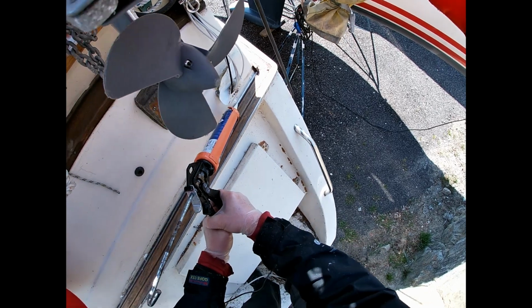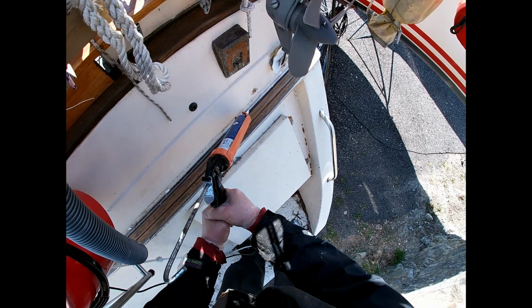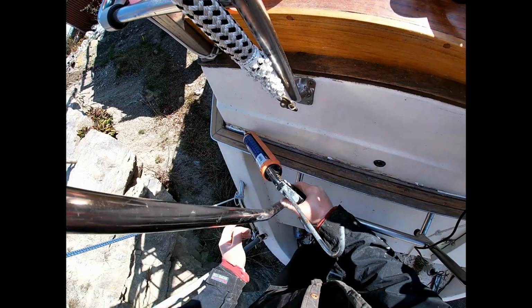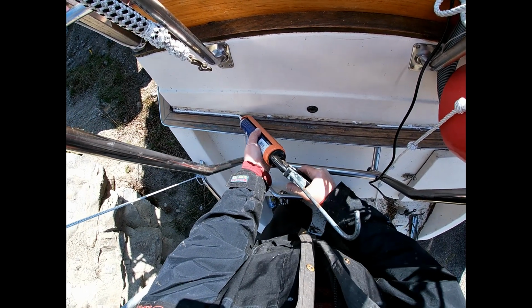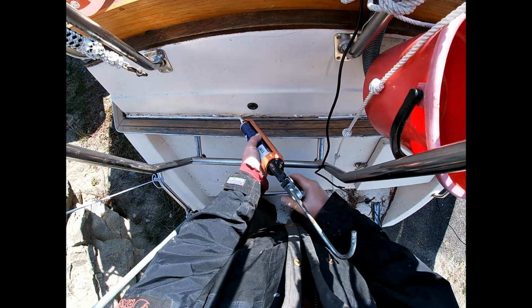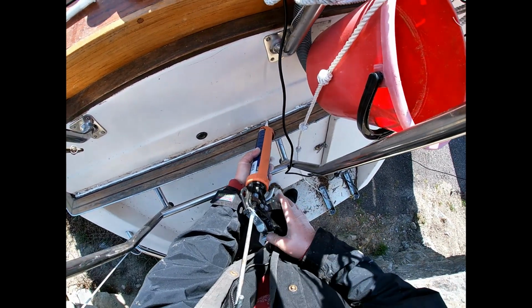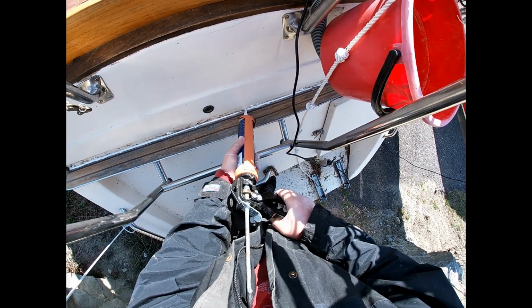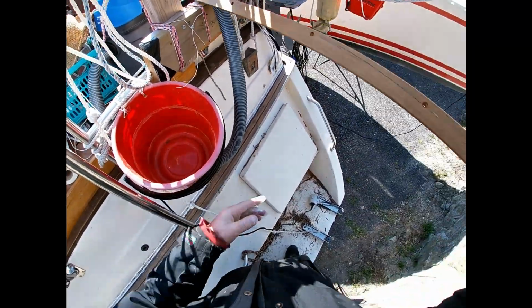And after I plug the old holes, I also put quite a lot of sealant at the bottom. Again, this will not be visible. This is just sealing at the bottom of the new wood. I will seal this both in the front towards the other wood and also against the hull, and for that I will use a brown sealant, the same as all other wood is sealed. But for this I'm putting white sealant at the bottom where I can put the new teak in.